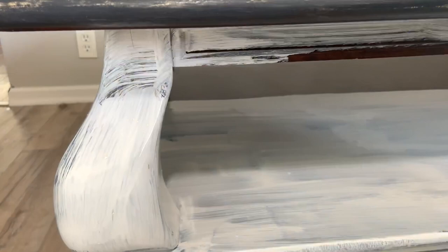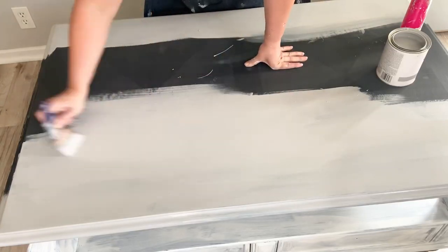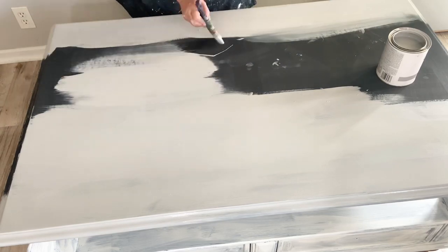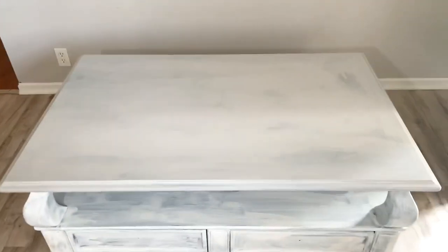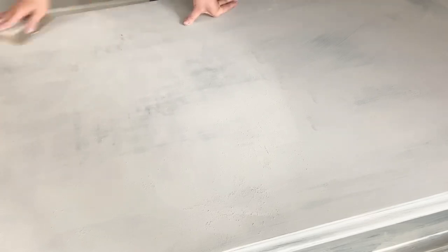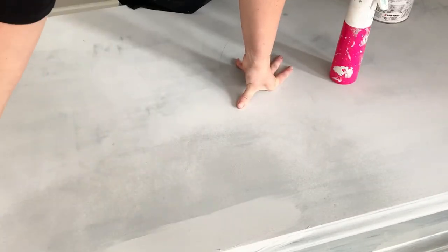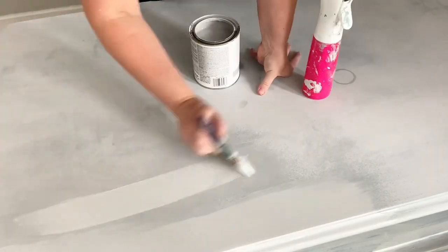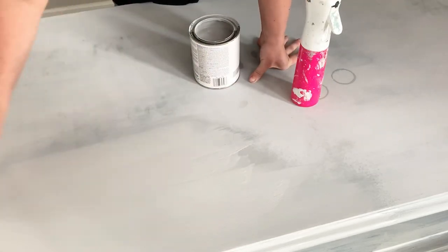Maybe because I'm not feeling well, or maybe because this table is cursed, I was just having bad luck. Even my primer was going on sort of gloppy and I wasn't happy about it. At this point I started using Rust-Oleum's Chalked Aged Gray on the top and I forgot to hit the record button. So here I am mid-through covering the General Finishes with some chalk paint. As my luck would have it with this table, I'm getting tons of brush strokes, so I take my sanding pad and sand in between each coat. And a quick tip — if you have one of those handheld vacuums, it just makes the cleanup really easy. So here I go with my water mister for a second coat of the Aged Gray. I use my water mister so that I don't have a lot of brush strokes, but for some reason it's just not happening.